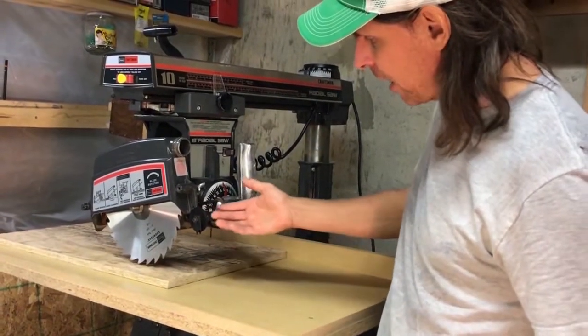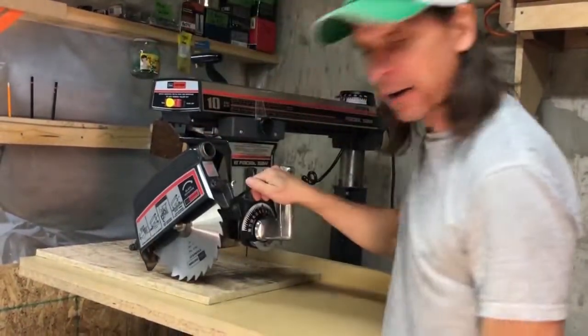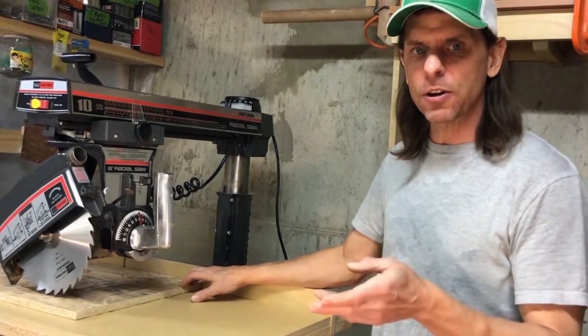There's no guards on this side. You won't have your anti-kickback pawl set up on this side. The nose of the guard that holds the blade down is over on that side, and that protects your hand from going in. So a wrong way feed is extremely dangerous — never do it.